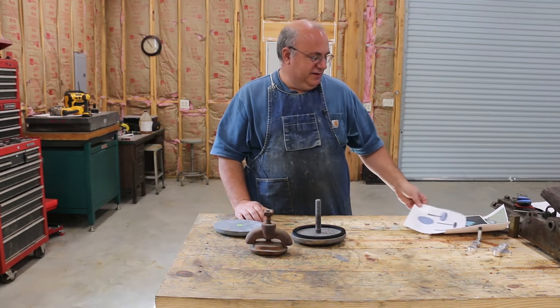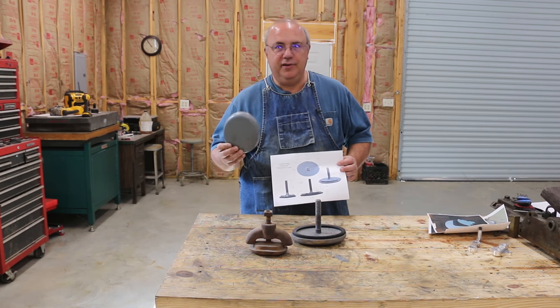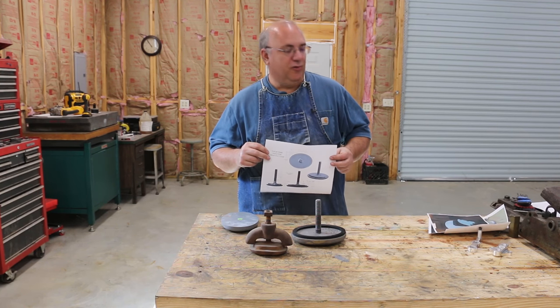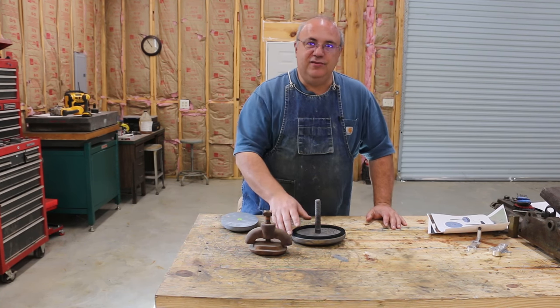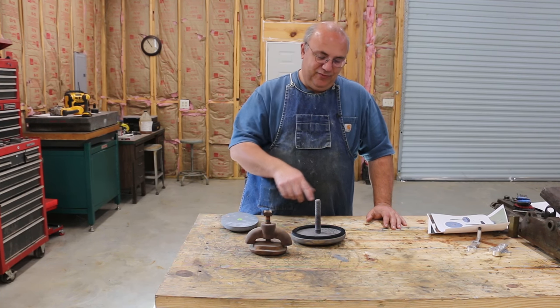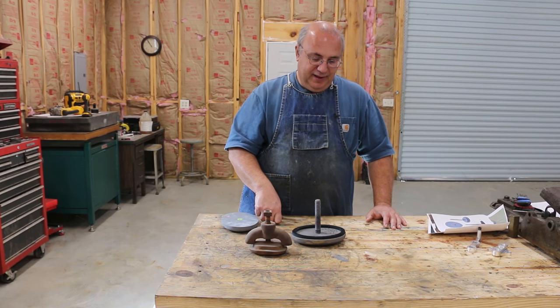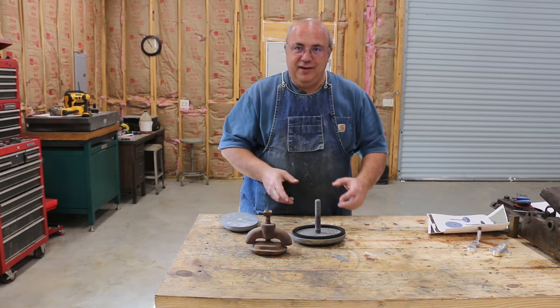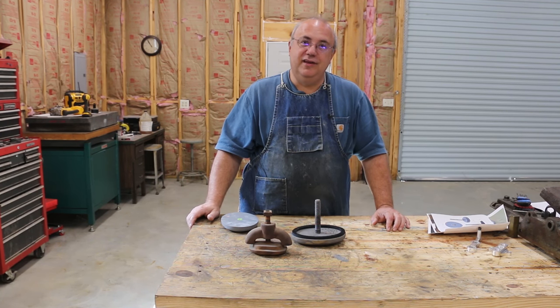Part one of the collaborative project is Charles Marlin drawing this up and printing it out — he has a short video on that which I'll link in the description below. Now my challenge is we've got to actually mill that notch all the way around, but because this is an oval — an ellipse — it's really not a very practical job on my manual milling machine. Could it be done? Yeah, you could do it a little step at a time; my DRO actually has a function that can give you coordinates to navigate to. But it's a lot of work and really difficult to do manually. This is a job very well suited for CNC.